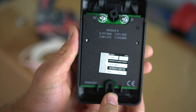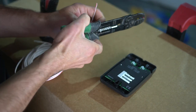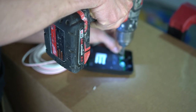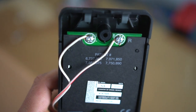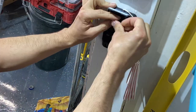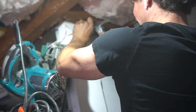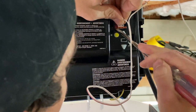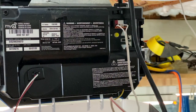Now comes the funnest portion of any DIY project — the wiring. In all honesty the wiring in this type of application is very simplistic and very DIY friendly. The wiring that comes with the door opener control box is a two-part wire: one part is white and red, and the other is solid white. The screws on the back side say W for white and R for red — very simple and easy to differentiate. Once you determine where the door module is going, you fasten one screw to the bottom side, then flip the top flap up and install the second screw overhead. Then go ahead and start pinning the wire to the surrounding surfaces with the staples that come with the kit. The left side of the opener has a red position where the red-and-white wire goes, and the first white connector on the left side is where the white wire goes.